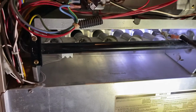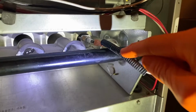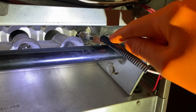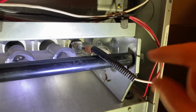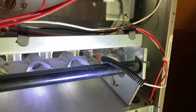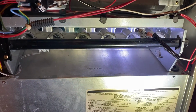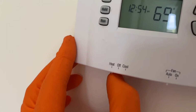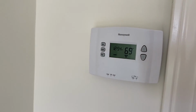And verify you're not leaving any tools or parts behind. And one last thing prior to turning the furnace and system back on, you got a little protector too that protects your wiring to make sure this is properly placed in position to protect your wire. I will turn this switch back on, head back upstairs, and turn the heat on at the wall-mounted thermostat. Back upstairs at the thermostat, carefully shift that tab back to heat. Let's go back downstairs to the furnace room.